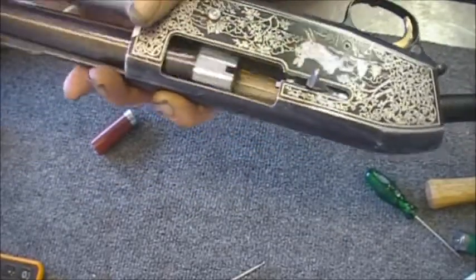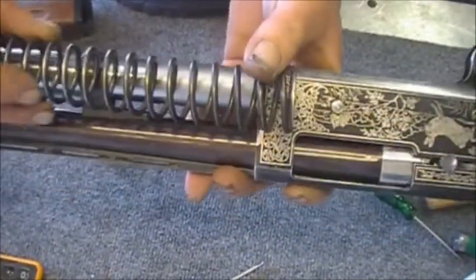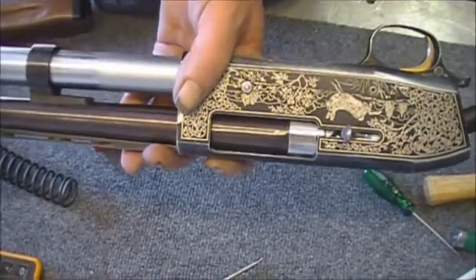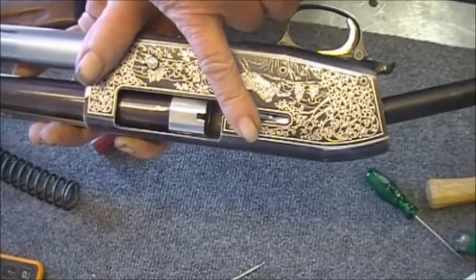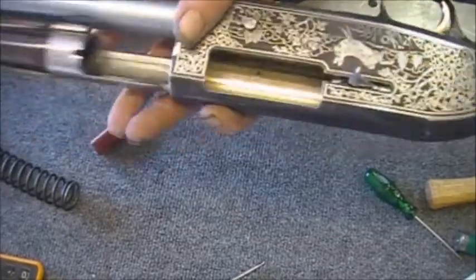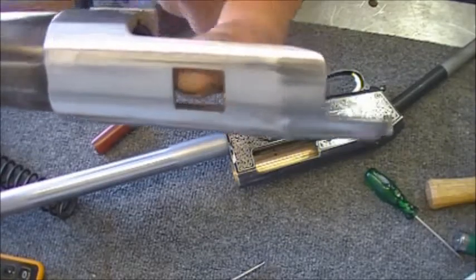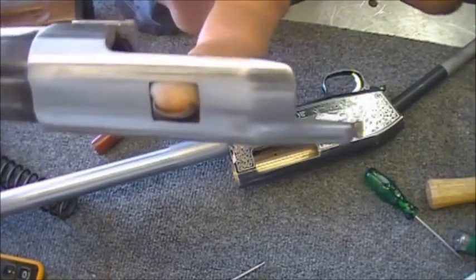So what's going to happen when I take this out to the field and shoot it? I've got a massive spring shoving this barrel forward. That barrel's coming forward — it doesn't care. If I don't unlock my bolt, it's going to pull that bolt forward. We've got a big hunk of iron sticking through this hole, and if we don't get that hunk of iron out of there, this is going forward and it's going to drag anything hooked to it forward.